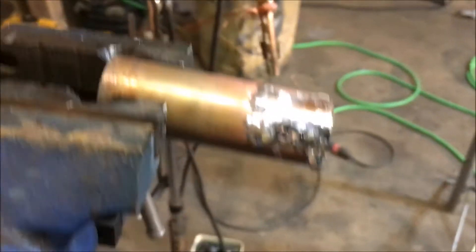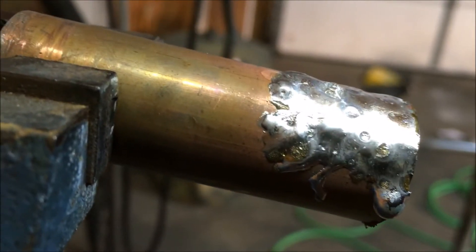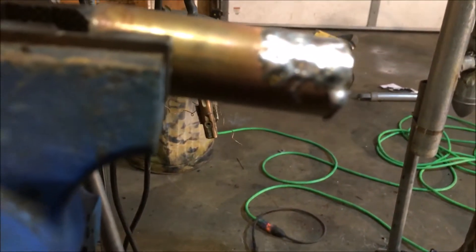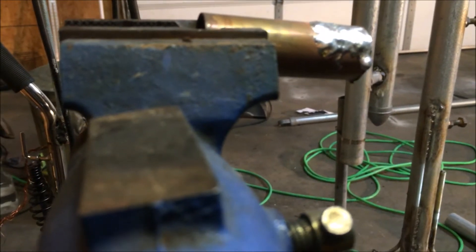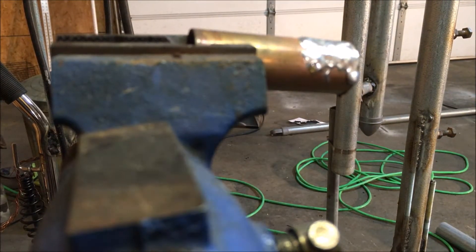Sometimes you get left with this really nasty mess. It'll brown up once it cools down and really start looking funky — there's just some acidy, resin-looking stuff left over. If you ever use it on or around electrical components, it'll corrode up big time.